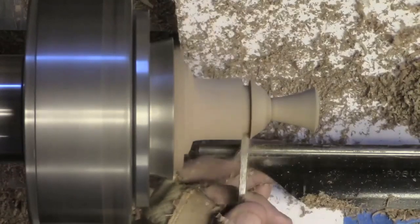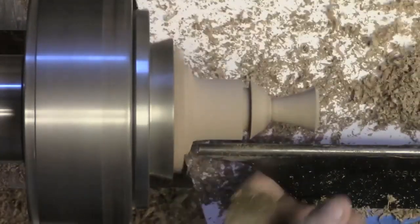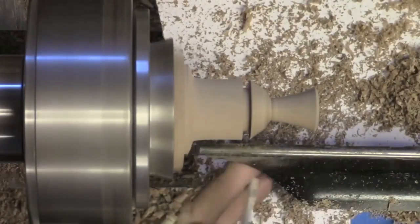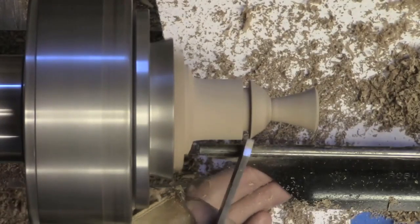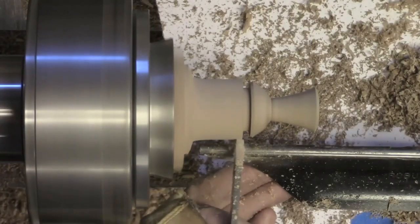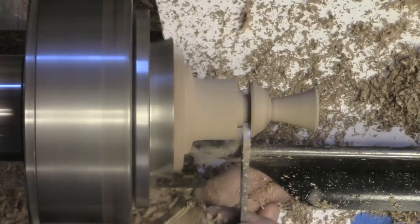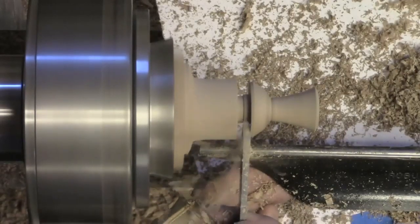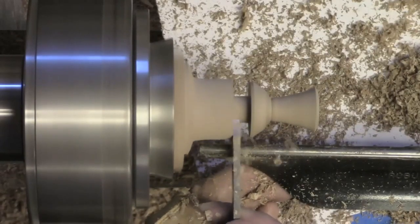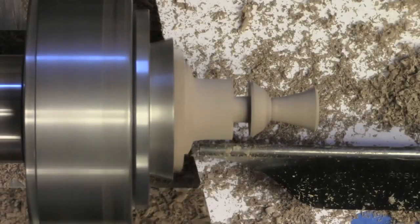Adding just a slight little detail right in there. This is where it's going to come off - I'm creating a small groove, and a small chamfer right here. The hole in the top is three-eighths of an inch in my lid, so I know how big to make the tenon here. I'll grab my calipers which I've already set for three-eighths.